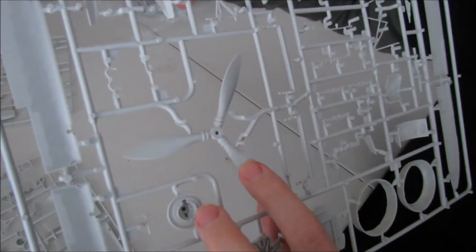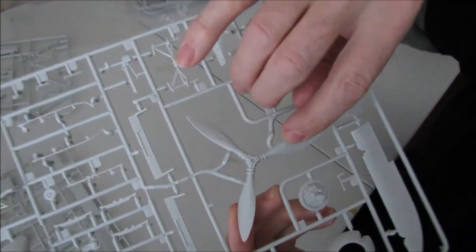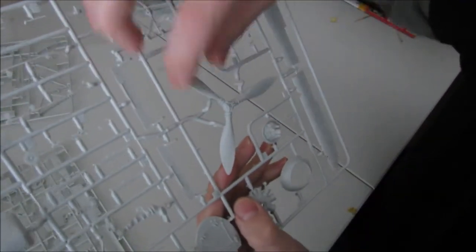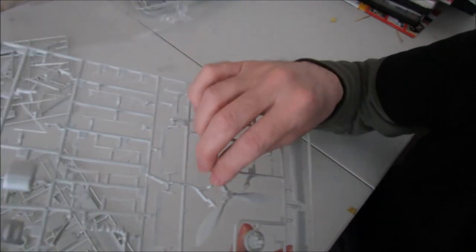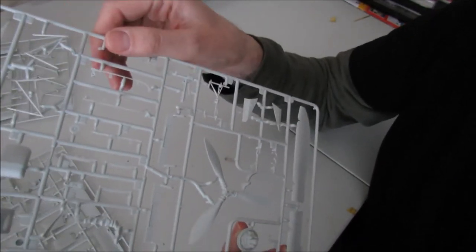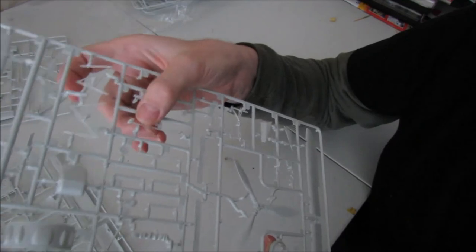The sink there, look, on that one, and then sink there, and there's partial sink on that blade. But they're thick sections, and it's a balance of trying to pack out those thick sections. If you try to, you're going to start blowing the parting areas around the smaller sections and getting flash around those.